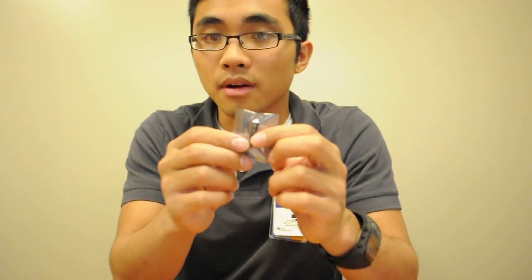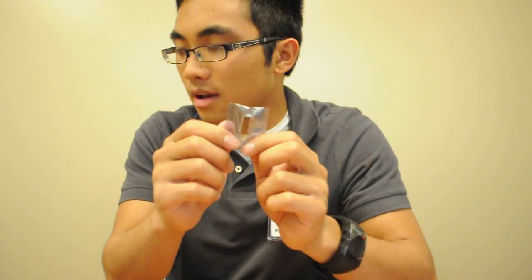Also within the flap, you've got your microcontrollers. We actually provide two MSP430 ValueLine devices. The one in the bag is the G2211 device, which features an on-chip comparator. The other is the G2231 device, which is actually pre-programmed with some demo functionality.